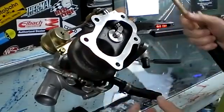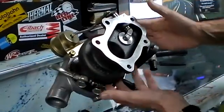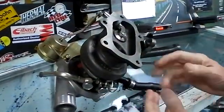Inserted the steel retaining clip. Then you take your dead blow, slim punch or a flat blade, and you have to go all the way around this and tap it in. The lines weren't on when we did this. So if you don't seat that clip, the turbo is going to loosen up eventually and it's going to take itself out.